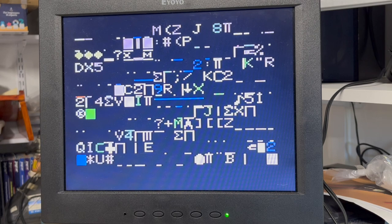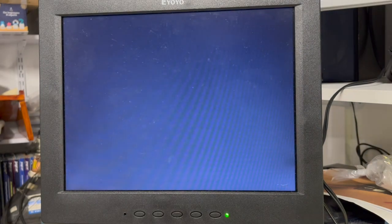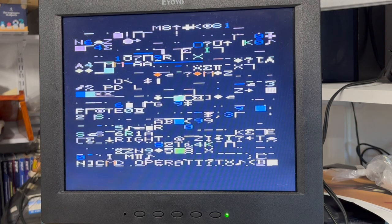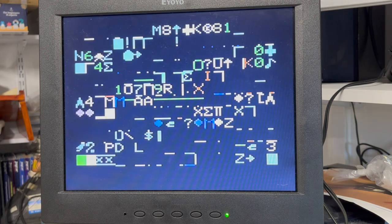Okay. I don't know, look, maybe a RAM issue. I've got three RAM chips on here. Maybe the keyboard decoder as well. Okay, off, on. Interesting. So yeah, definitely the 120 picofarad is disconnected, so the chroma is not being, well, as far as I know, it's not being coupled in to the luma output. Very interesting effect. Okay, getting there. We'll get there. Okay, time for a break.